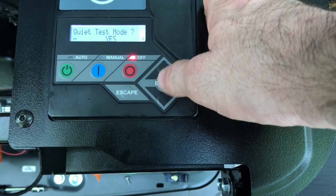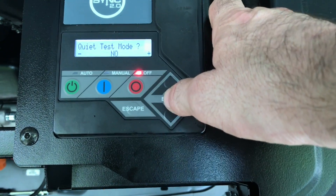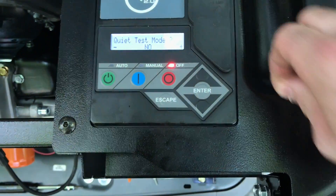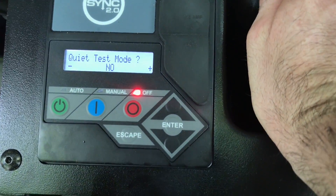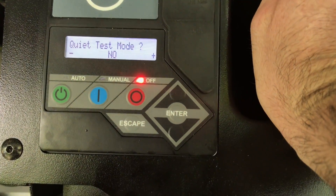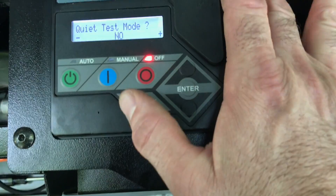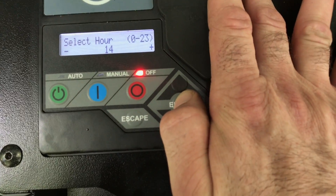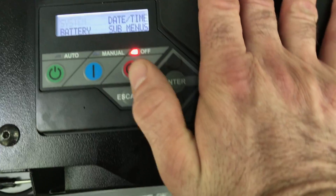Exercise: weekly, quiet test mode. Never set quiet test mode — it's meant to run at 3,600 RPMs to get 60 clean hertz out of the rotor, but unfortunately it runs at half that speed and it sounds like it's going to stall, which is what almost everybody tells me. I'm going to set it to two o'clock until I talk to the customer on Wednesday.